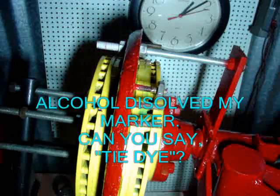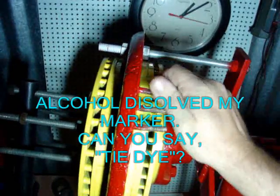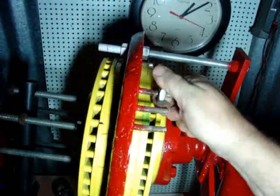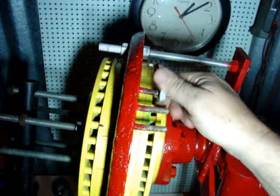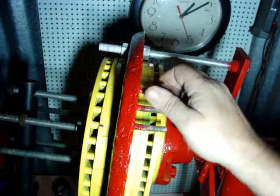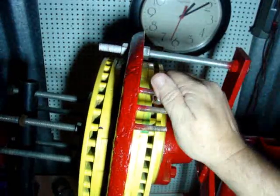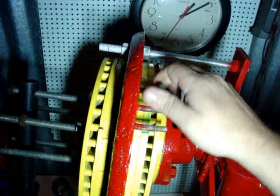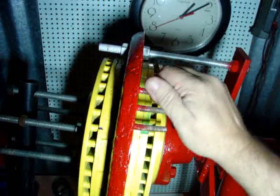I'll add a little bit of alcohol. You notice the blue spot on the rotor — I made the mark on the 12th magnet up there. The alcohol acts as a lubricant and keeps this stuff from re-sticking back into the threads. Back it off a little bit and clean it up. Chasing your threads just carves and takes everything completely off.